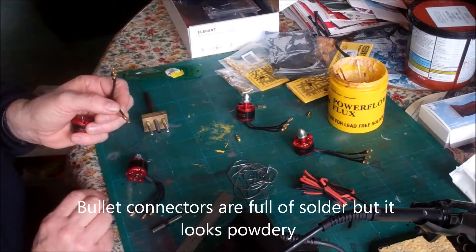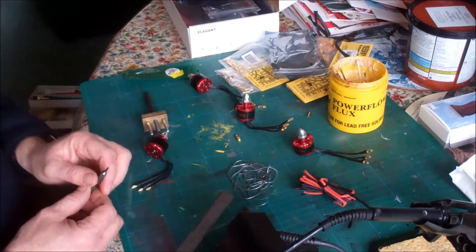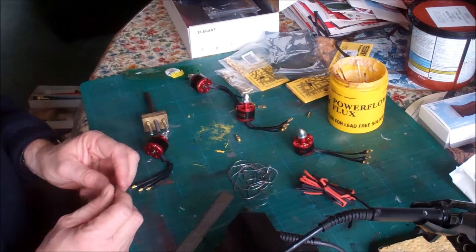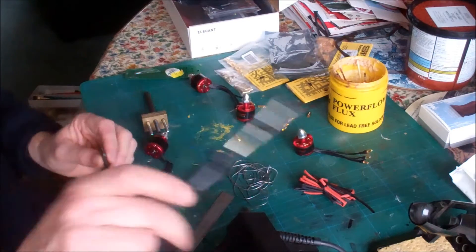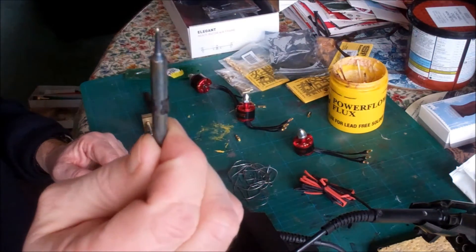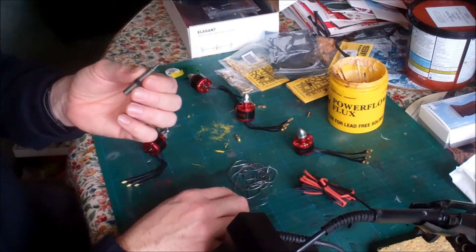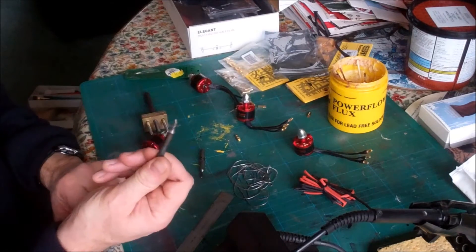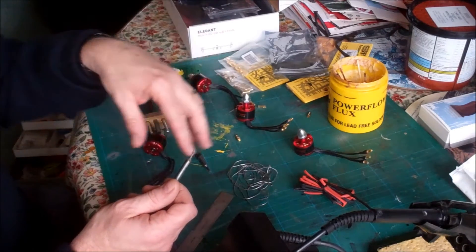I don't think I'm going to trust it. But first I'd like to say a few words on soldering. I've seen some funny efforts on the internet. I've got an Antex 690 SD digital soldering iron station — this has a box where you can change the temperature and the soldering iron with interchangeable bits. One of the funniest ones I've seen is a guy trying to solder up the wires on his flame wheel using a pointed tip. They're no good for this sort of work at all — that's for printed circuit board work. There's no heat reserve in these.